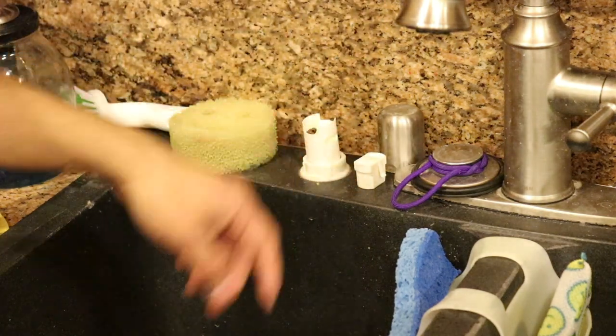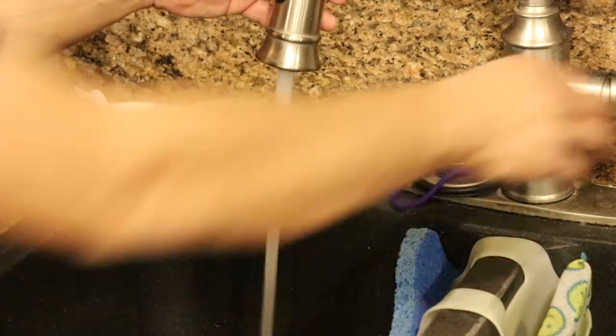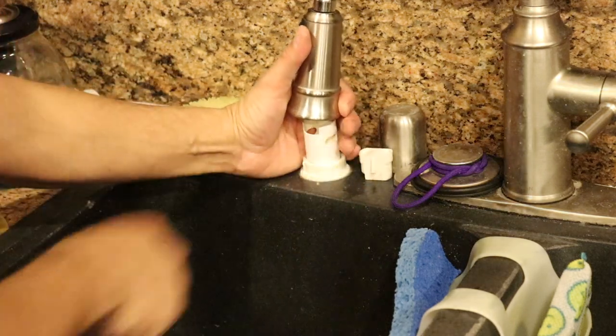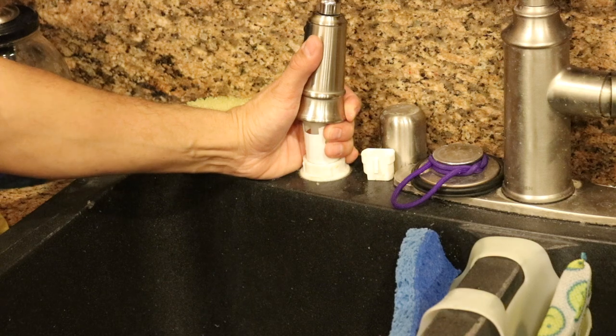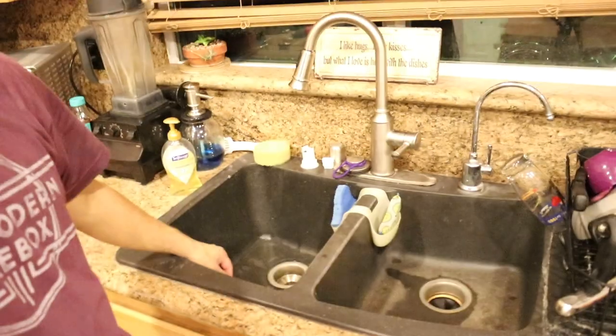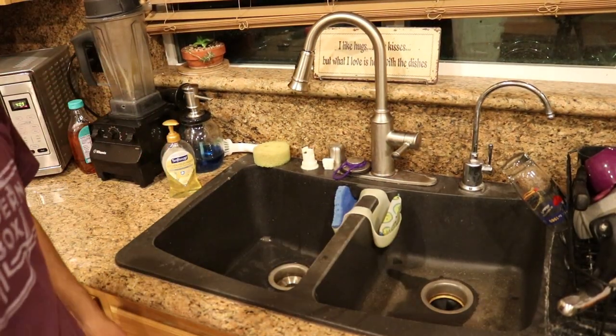Now what we want to do is put some water in there. I'm going to take my hose here from my faucet, put it right on top and curl my fingers behind so that any excess goes back into the sink. What this does is wash out the connection between this side of the sink and the side where the garbage disposal is.